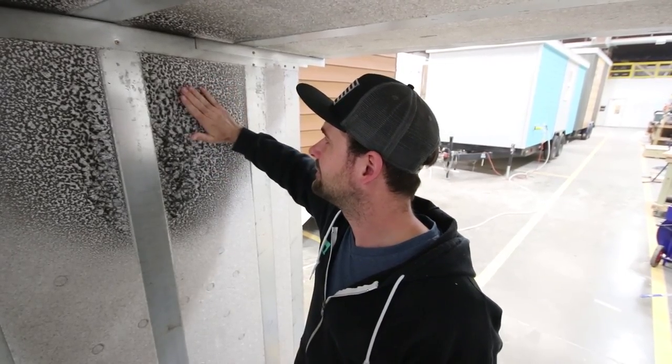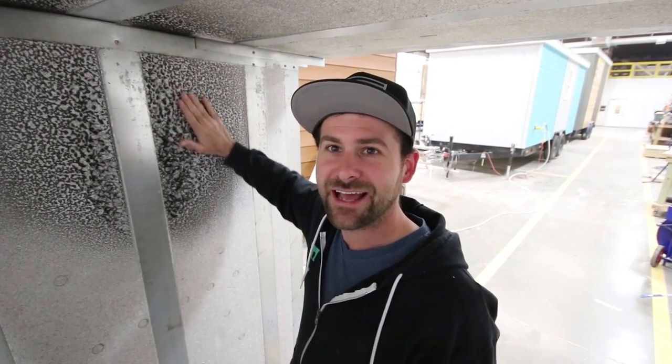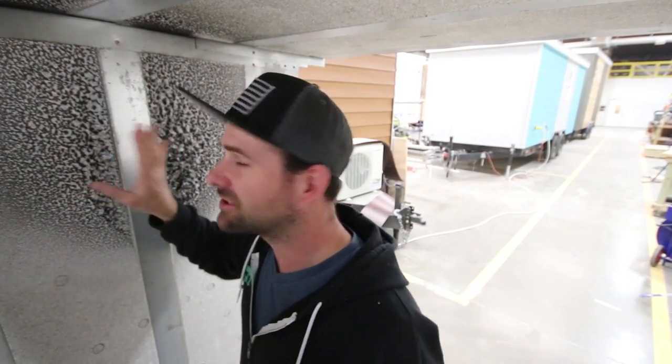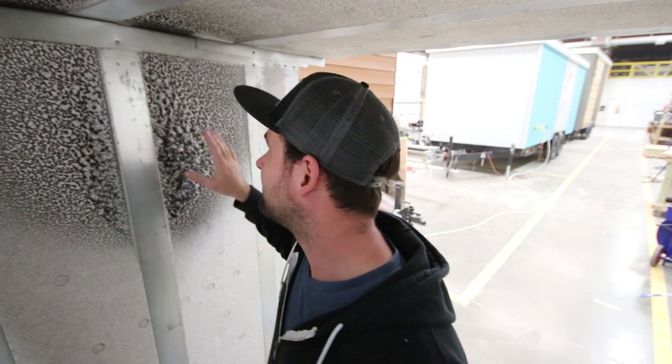And see, nice and soft to the touch. It always scares me a little bit after I torch the hell out of a wall to touch it again. Now, there's something very interesting going on here. Did you hear the snap, crackle, and pop? Much similar to what you would hear in Rice Krispie treats. You hear that? All right, so that's moisture in the wall system, which brings me to my next point.